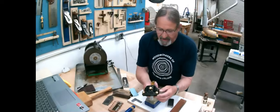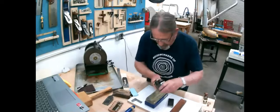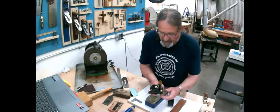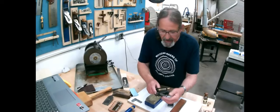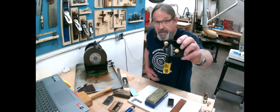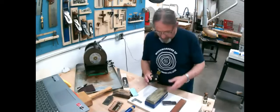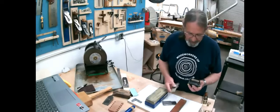What it does is enable you — this is the clamp that holds the blade, it's wide enough for a plane blade. There's a roller on the bottom that rolls back and forth on your stone. You set the chisel in here upside down so that the bevel is the part we're going to sharpen. You don't use these jigs for sharpening the back. I'm reasonably good at eyeballing square, but this is clearly not square, and I have no idea how to get that angle precisely except by eyeballing.